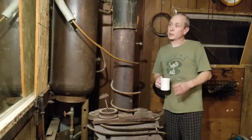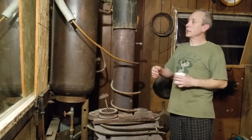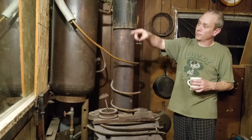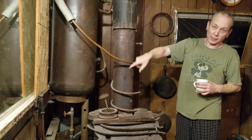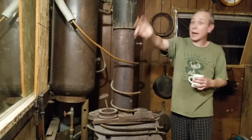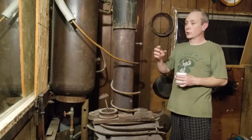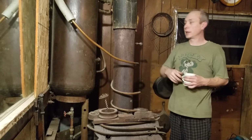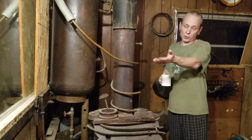Now this system is plumbed in what's known as a tempering tank. What that means is that this tank gets cold water from the water pump. It goes through this tank and then out of this tank at the top, comes into this tank at the bottom, goes out of this tank at the top, and goes into a gas hot water heater that's in the utility room, so that it feeds preheated water into the gas hot water heater, the idea being that when you're running the stove it partially heats the water so you don't burn as much gas.